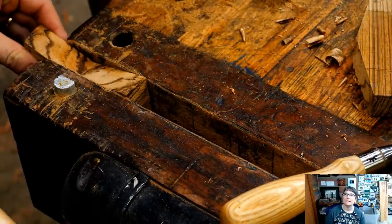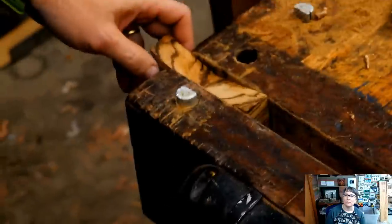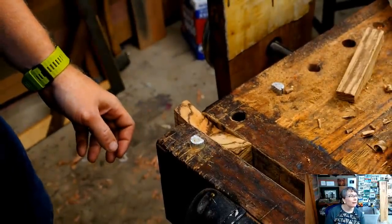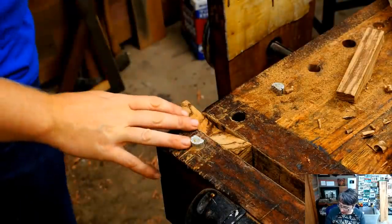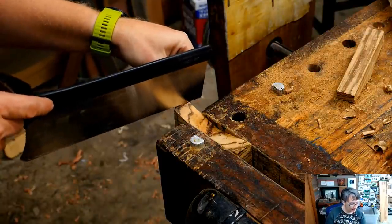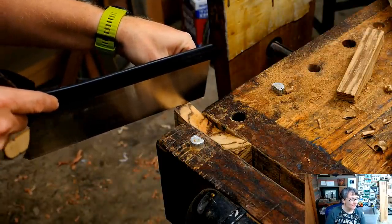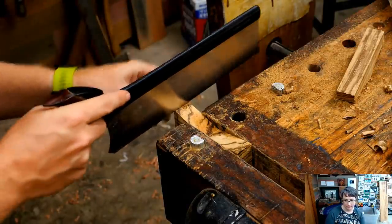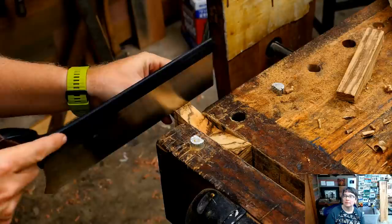And then we can cut that off. Put it into the vise. And come up here. Sorry, I was out of shot. I'm trying to figure out why you call it light, medium, and hard. You push light on the first stroke with the knife, you push medium, and then you push hard. It just seems counterintuitive, because if you push hard on the first stroke, it tends to push the square off of your line.